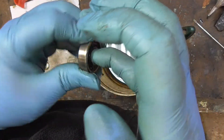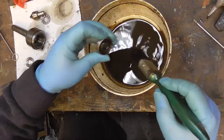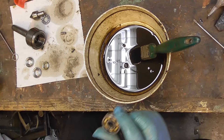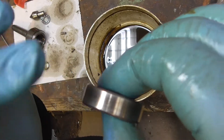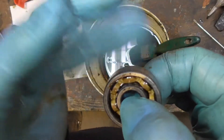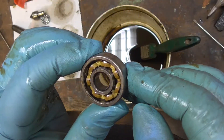That bearing actually feels quite rough. I might just try and quickly clean it up - I'll just wash it out, see what happens. I'll just blow that out with an airline. Yeah, that's cream-crackered. Got a right old notch going on it there. So I think that one is scrap. On to the next one.